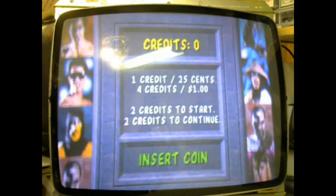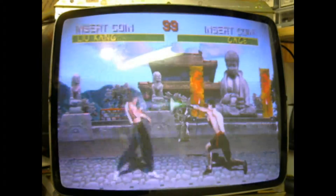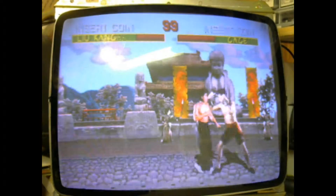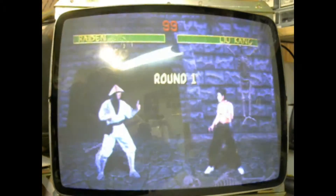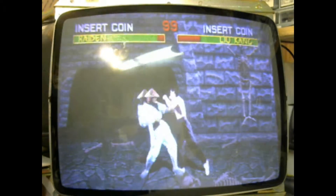The next chassis I will be doing something extra. So this one was a chassis I had laying around — got it somewhere, I don't remember where. Got it all fixed up — put a cap kit on it and flyback reflow, and before I fired it up I had to put a voltage regulator and a fuse on it.